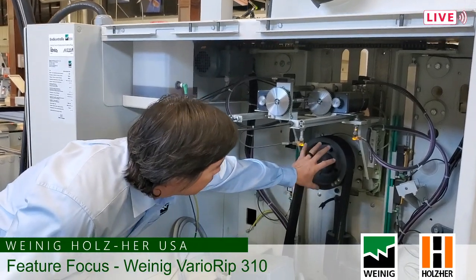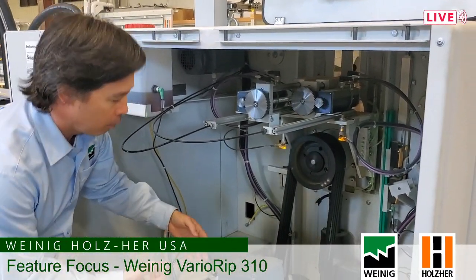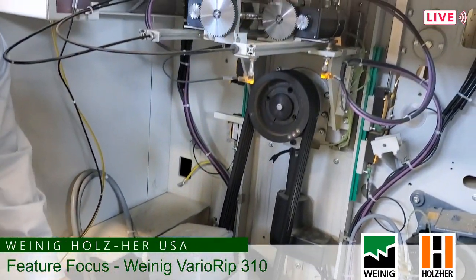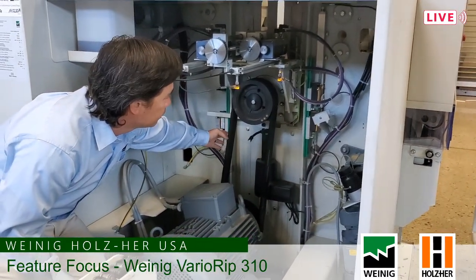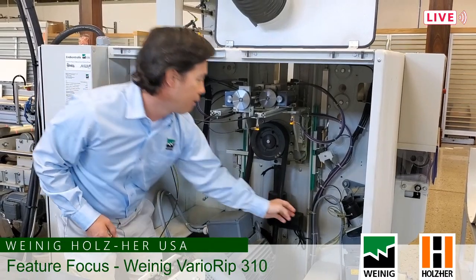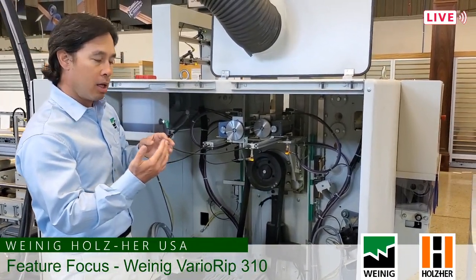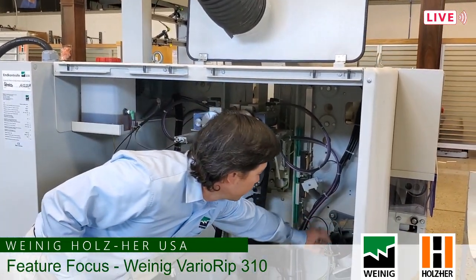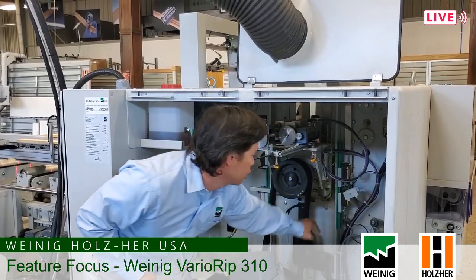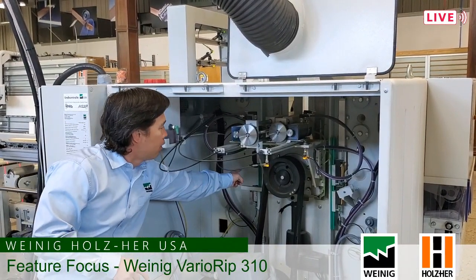This is our arbor — the back side of the saw arbor. We do not have a one-piece arbor and motor combined. We separate the arbor and the motor to help eliminate any vibrations that could be coming from your motor, and it's all belt-driven. We also have our oil pump for the feed chain — we lubricate the feed chain at four different points, which run back up underneath the machine and place lubrication onto the feed chain. This is our feed chain motor in a gearbox. These are limit switches — for your pressure, the thickness of your material, your pressure rollers going up and down, and for your arbor to go up and down.